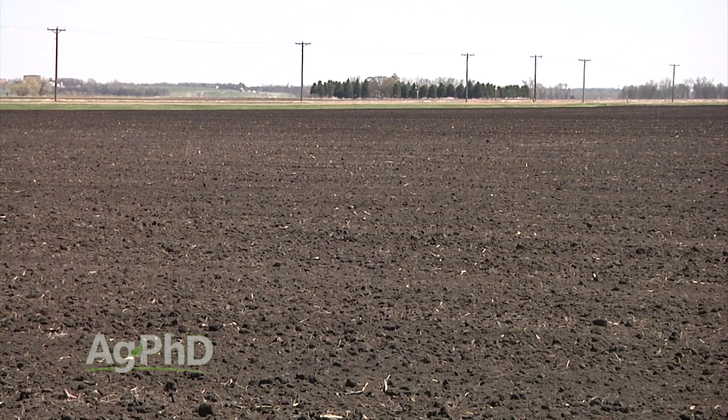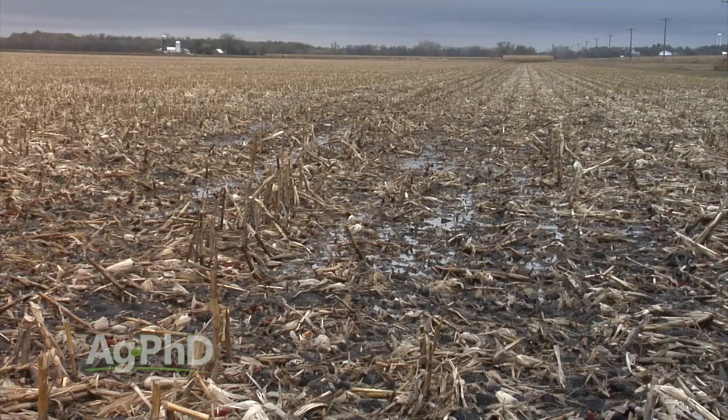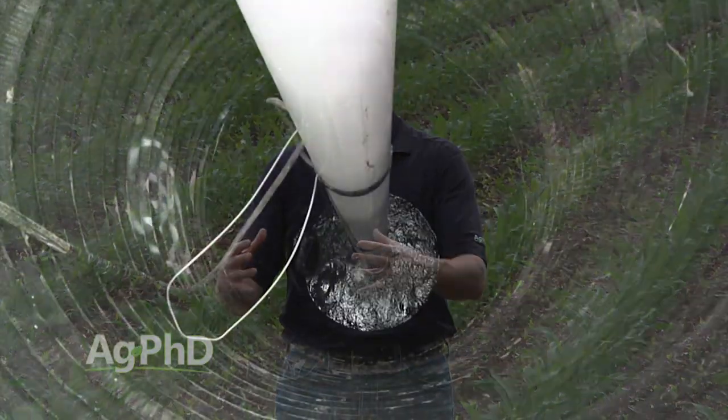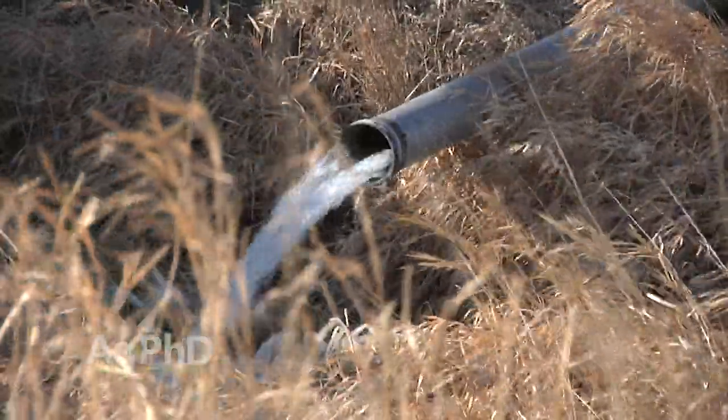Maybe you have very, very flat ground. This is the case in many areas of the country where it's just tabletop flat out in the fields. Well, how do you get things to drain if it's all flat? If you've got a whole bunch of water on a flat surface you've got to create your own drainage. With drainage tile, for example, you can slope that tile down below the soil surface — maybe 3 feet below on one end of the field and 5 feet below on the other end. Many times you'll run that into a basin or a tank and then pump it out of the field with a lift station.